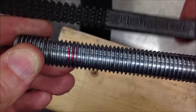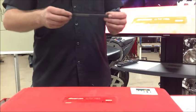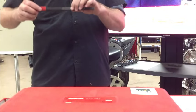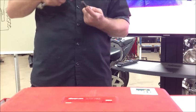We're going to find our number 11 on the tool. What I want to do is put the handle on the opposite side. Then I'm going to take my finger on top and switch this into position so I don't end up on the wrong pitch. Because what this is, is like a draw file — I'm going to take it and go across the threads, filing them back into position. Do you see how easy it'd be to accidentally move off of the intended thread pitch? Once you see that application, we'll move on.